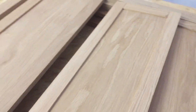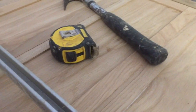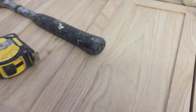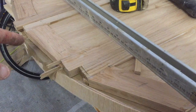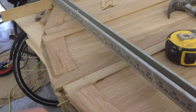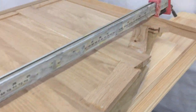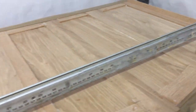Over here on the bench these were already glued up. I found it best to glue them all up in position, and then once they're all dry tomorrow I'll clean them all up. I've still got the top part of the frame to go on here. After I've glued these up I'm going to router them out, then offer it up, mark off the top with a pencil, cut that on the bandsaw, and then fit the hinges. There's one there and another one up there all glued up in clamps.